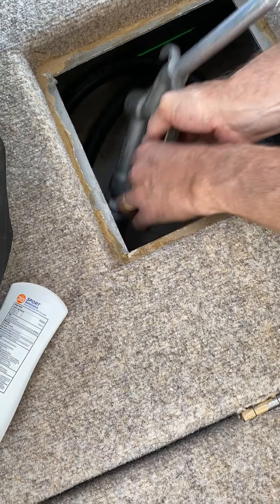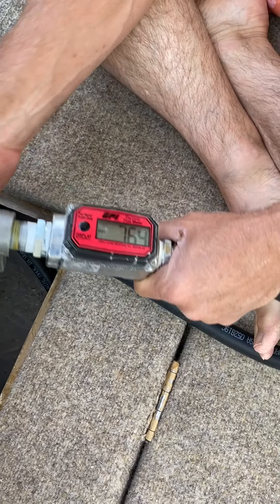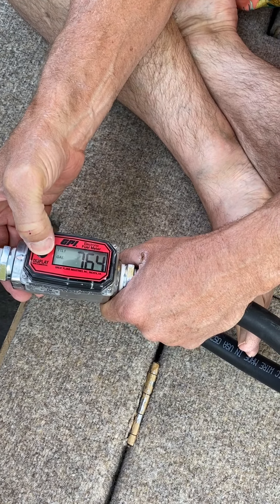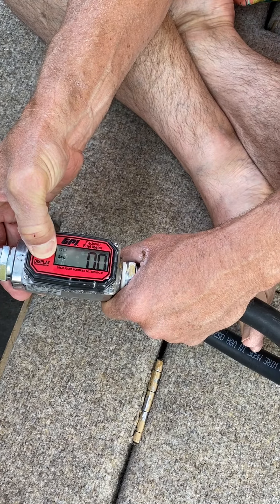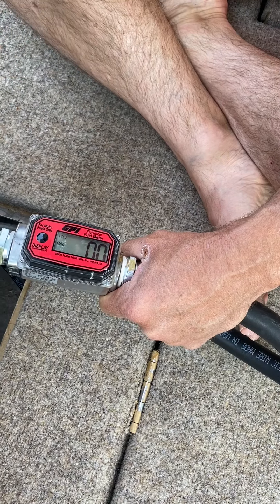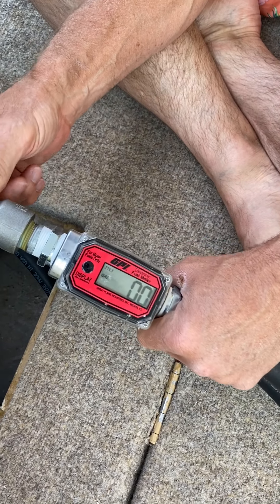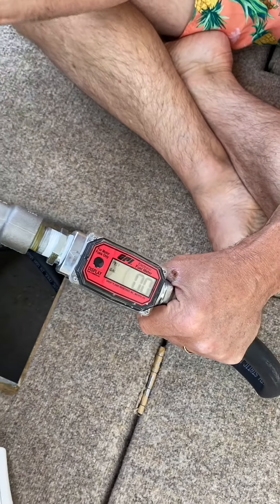That's how you manage fuel on the Kapalua. And to know how much fuel you've used, we installed a fuel gauge — we'll show you how that works. So here you are. As you can see, we've recently pumped out about 76 gallons of fuel. We'll clear that — you just push this button and hold it, just like your trip meter on your car, and you see that it clears. That way you can know how much fuel you've pumped off each time. Or if you want to do cumulative, just let it run the entire time you're out on the boat, and you'll know how much fuel you've pumped off.